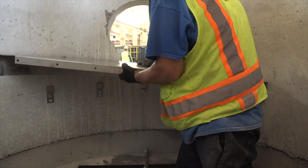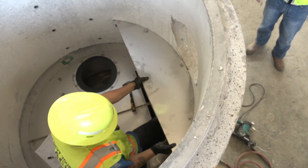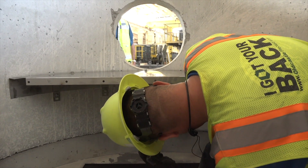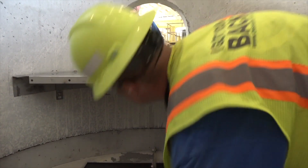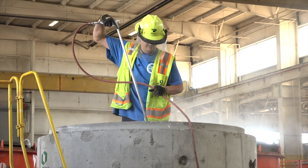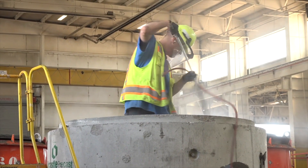Next, install the upper support ring over the clips. Measure to make sure it's still in alignment. Measure from the end of each side of the upper support ring to the outlet baffle assembly to make sure they are equal in distance on each side. Clean up the dust and loose concrete pieces off the partition floor and out of all the gaps.